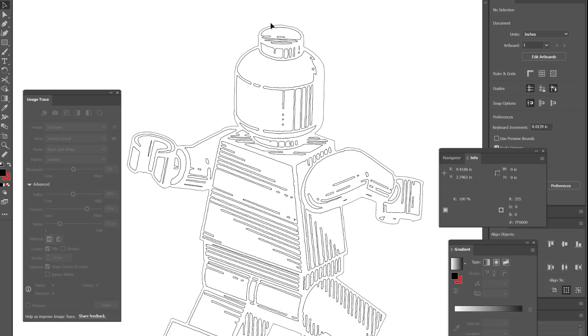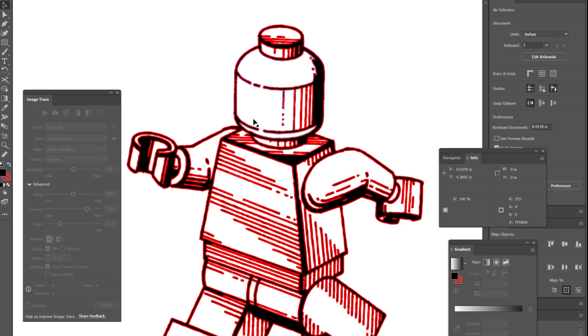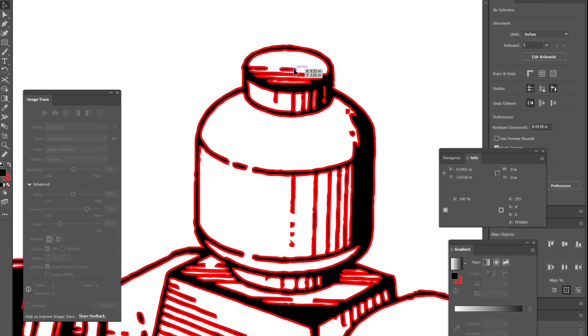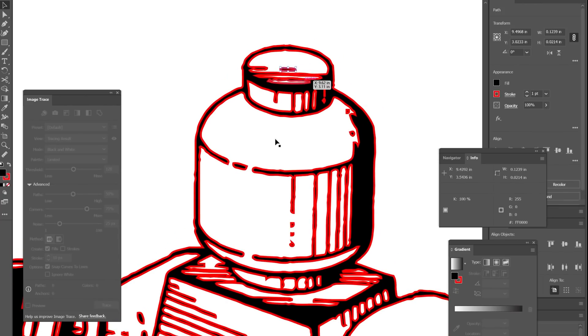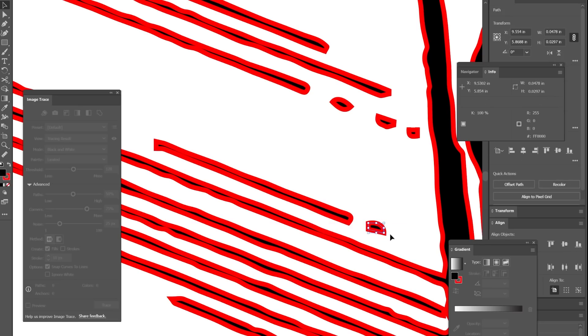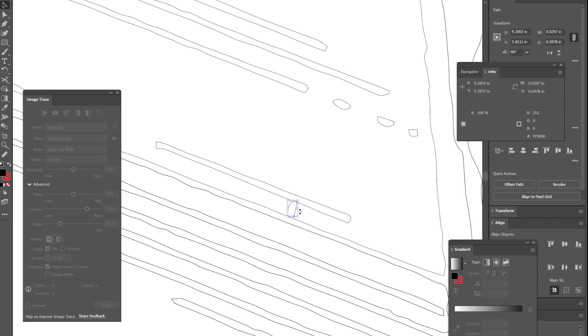The idea is to cut this out of not just clear acrylic, but solid acrylic on top of the clear one. You can see it looks like one continuous design with this outline, but what I'm highlighting here are kind of like islands. If I cut this out, those small little parts are going to fall through - they're not connected to anything. So I don't need them. I can click them and delete them, or I can take them and merge them with the design because I want the whole thing to be one contiguous piece.